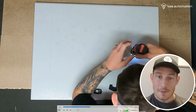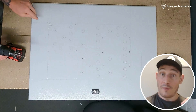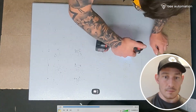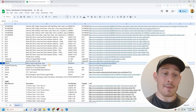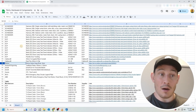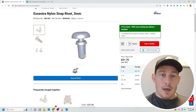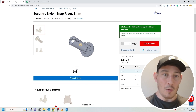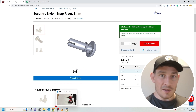The next step is the 3.2mm drill bit for the actual hole size at the corners of the plates. Drill all of those out — those holes are for the 3mm snap rivets that you can find on the parts, hardware, and components list. These are from RS. Once you push them in, this bit expands and holds the rivet within that hole. We're drilling at 3.2mm so there's clearance to get the rivet through the plate and into the enclosure door.